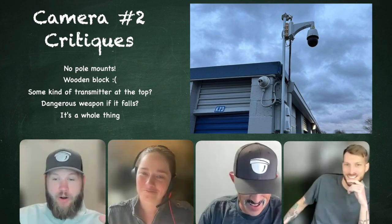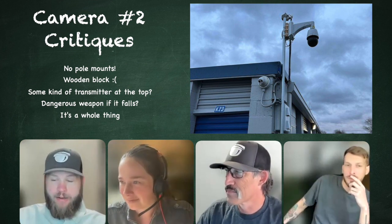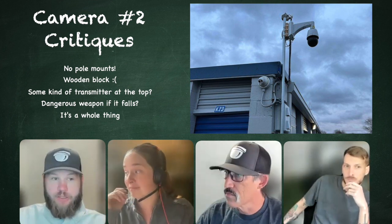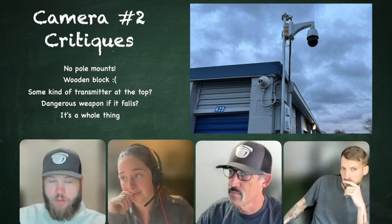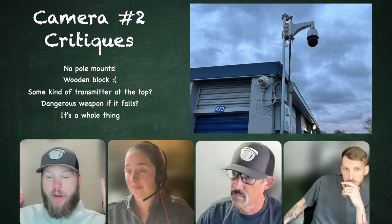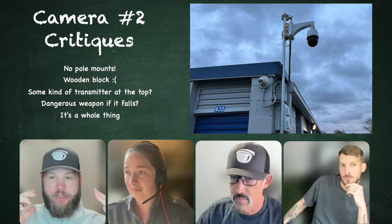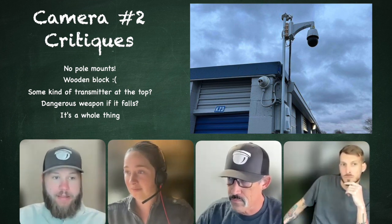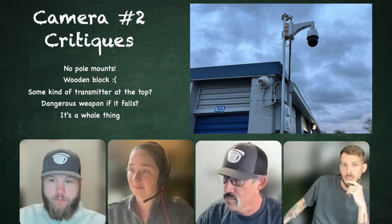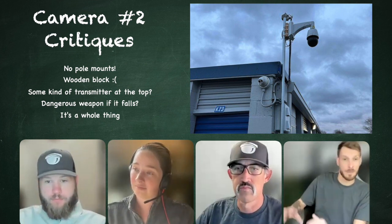That's actually a great point, though. One of the things I think is very common with a PTZ on a pole is that any kind of movement transfers a ton to the image, especially when you're zooming in on that PTZ. So if you don't have your pole steady and strong in the ground and cemented, you're going to see a lot of wobble if you're keeping that PTZ zoomed in. Just the slightest vibrations can be enough to really impact the image, the way it looks and the compression. That's how you learn, by making that mistake 100 times.